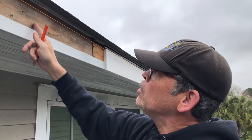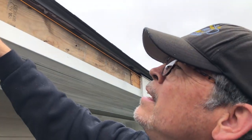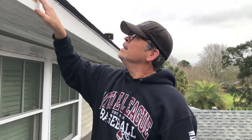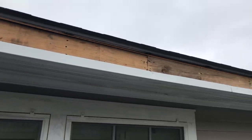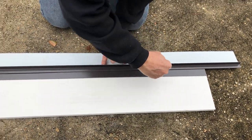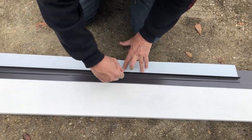What I'm doing now is putting a mark every two feet on the fascia board. There are a lot of old marks on it from when they built it, so I'm circling the marks I make. Jordan's going to measure from the string up to here, call that out to me, I'll transfer that measurement to our flashing, and then we'll cut the flashing to match. We noticed our string stretched overnight, so we're going to tighten it up real quick.